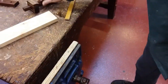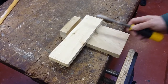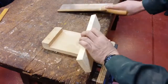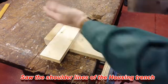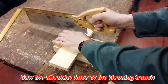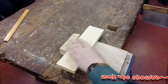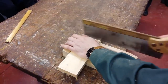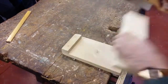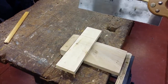Once you have the gauge line marked in, we're ready for the cutting. You can see I'm picking out a chisel that's going to suit the width of the trench. If it is a much bigger trench you may have to make an extra cut, but for this one an 18mm chisel is going to cut out a 20mm wide trench. I'm lining myself up with the saw using the backstroke into the bench hook — I have my heel of my hand pressuring down on the piece to keep it steady, and my thumb and finger are guides.